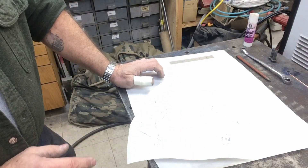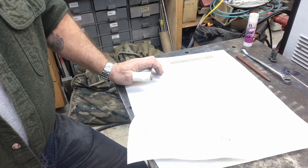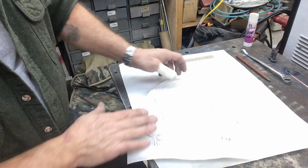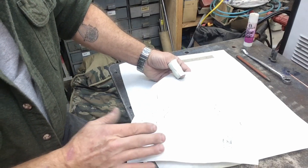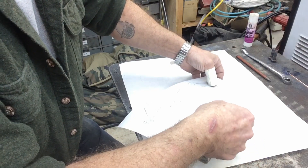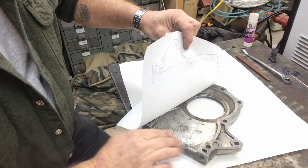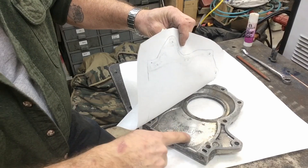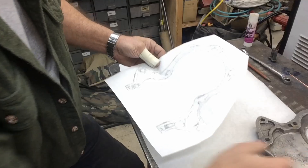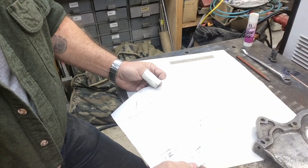It will be built up of a more modern material — plywood or hardboard — because it will inherently be more stable than older pattern-making techniques with sectioned pieces. Half-inch thick actually matches the thickness of our bosses here, so we've already established that plane. We'll add just a little bit to those on the outside of the pattern so we can machine them down flat when we drill and counterbore them. We can cut this out on the scroll saw or bandsaw — that'll be our first part of the pattern.